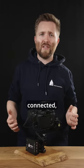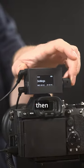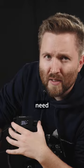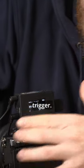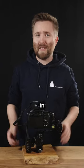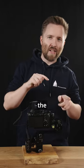Now that we have everything connected, it's time to configure the LR Timelapse Pro Timer. First, go to Settings and then to Second Port, and change the setting to Motion Trigger. Then go to Settings → Motion Trigger and set the time to minus 2 seconds. This means that in our interval, the Motion Control is triggered 2 seconds before the camera.